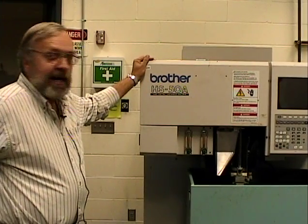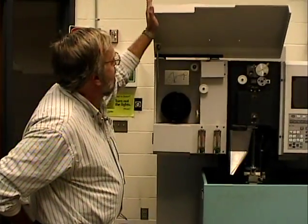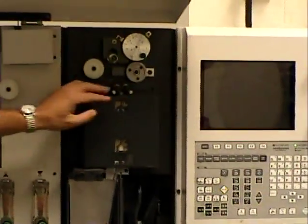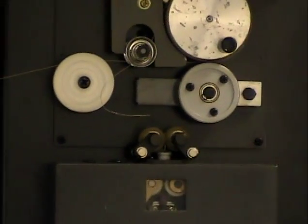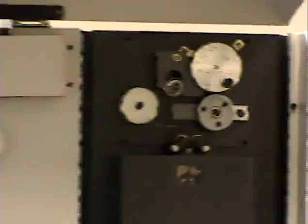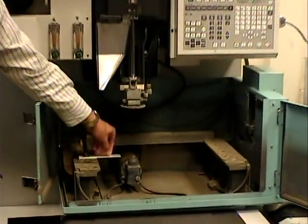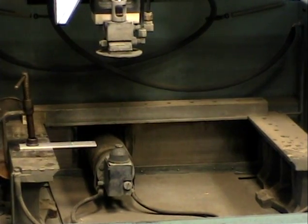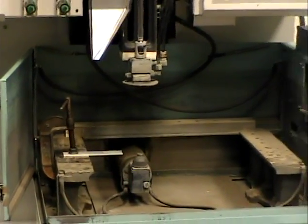This is a little bit different style of machining and manufacturing, in that the majority of the machining is done with a wire. We cut using a combination of a thin copper wire and an electrical spark. Inside the machine, the part gets mounted down here, and the wire circulates through, cutting into a tank full of water. Any material which is electrically conductive can be cut.